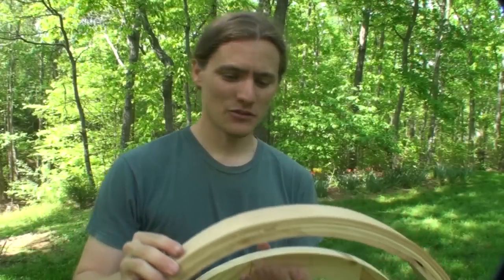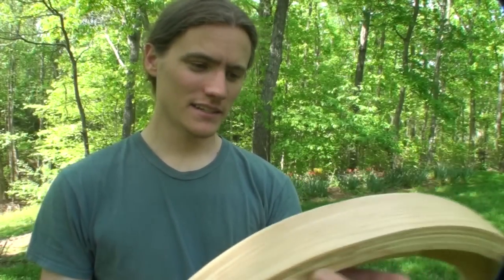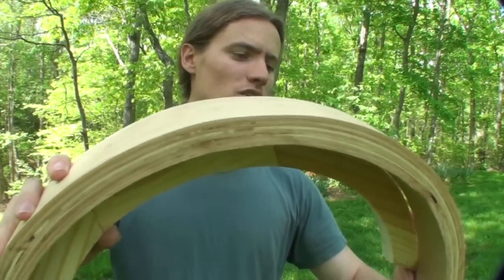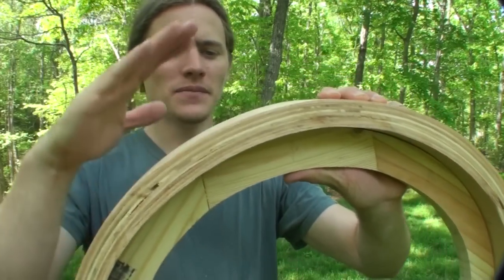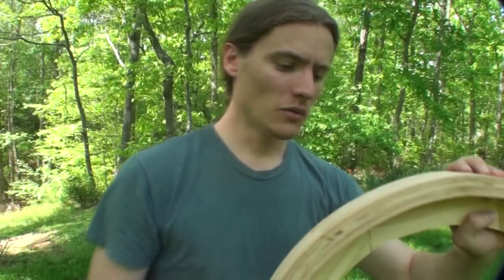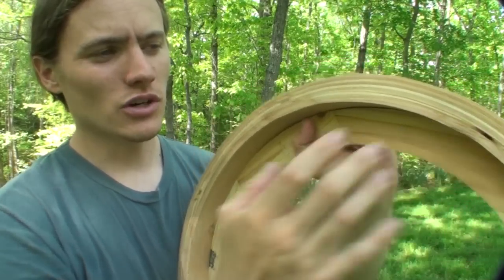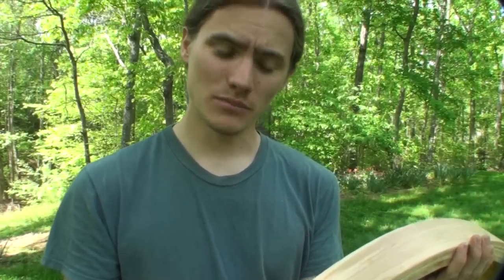So that wraps up the bend for today. Once again, this is the top part of a piece of trim for an archtop window, and I'm also putting together a video on that entire process — check my channel or click the link at the end of this video. Here is a shot of what it's going to look like roughly once it's mounted: you've got the inner part of the trim which is three pieces biscuit-joined together, and then the bend going around it, which stands out from that inner part. While this is a piece of trim and I can get away with some crudeness, if you were building furniture you'd want this bend to be a little nicer. The main thing to pay attention to is your clamping methods and doing a dry run — or doing a practice bend before you start the bends you'll actually use. If it works out, you can end up using it, of course.